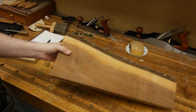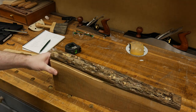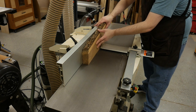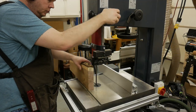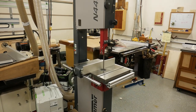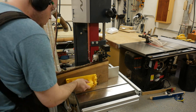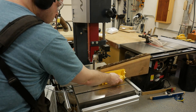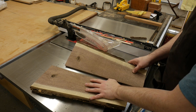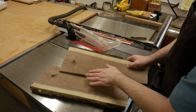To begin with, we're going to be breaking down this piece of walnut. We're going to joint one face, one edge, and then resaw it to get the pieces that I need and then plane it to final thickness. So I've got these re-sawing at the bandsaw. Now before I take them down to their final thickness, because I don't have a lot of room to play with, I'm going to cut the final two inch width piece out of this so that I'm not having to flatten the entire surface.